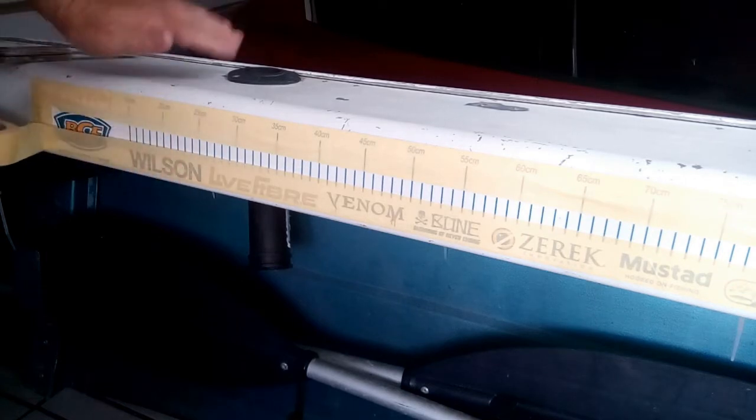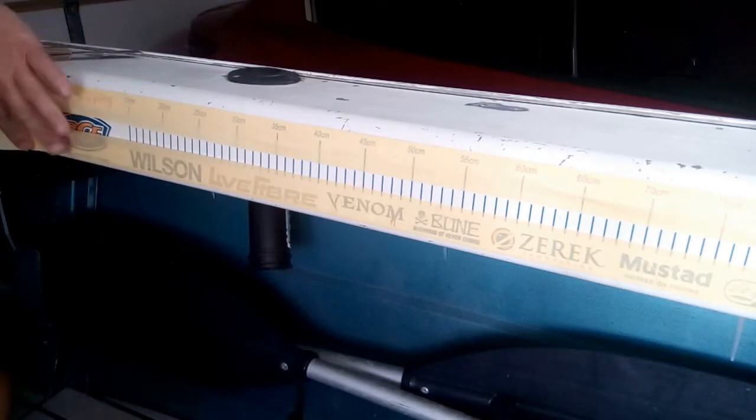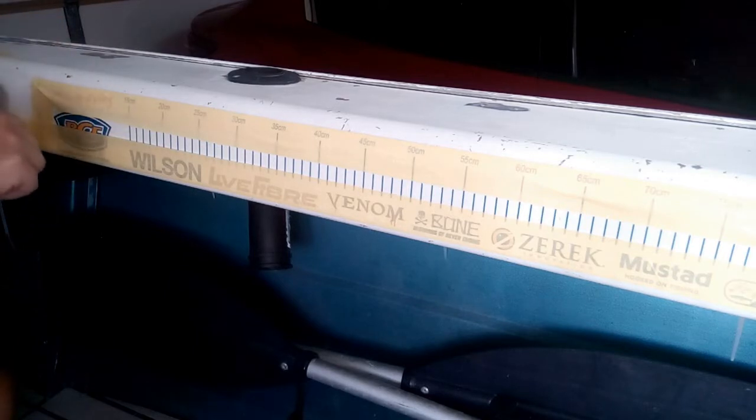If you're putting an enamel over the top — which is fine, it's totally suitable — one hour drying time, as long as the conditions are pretty normal. Obviously if it's freezing cold, different story. I'm in Australia, so we don't really have that. This is all the masking up — I'm going to mask up to that line there. Above that line is all I'm going to do; the rest of it is good enough, and it'll make it look new once finished.